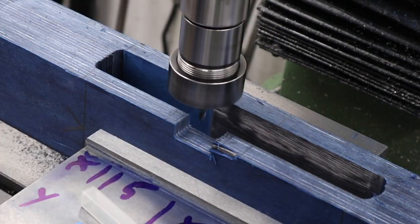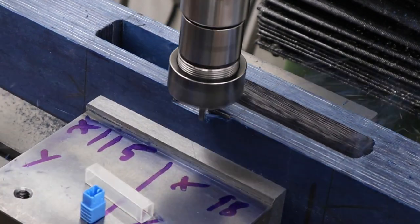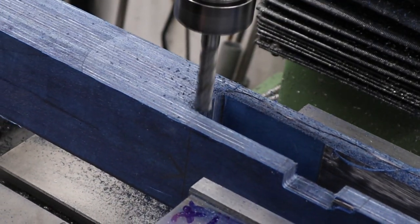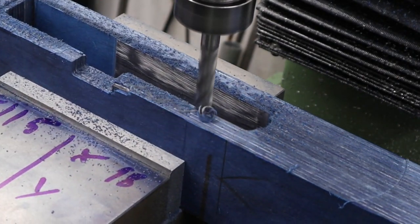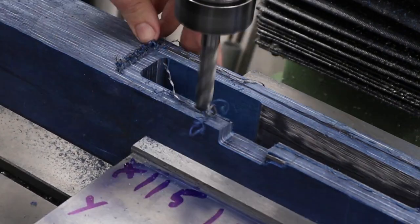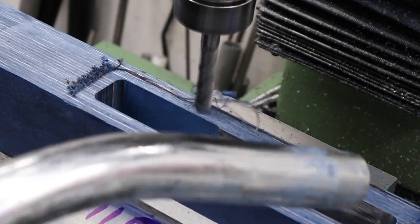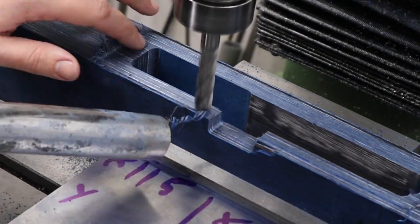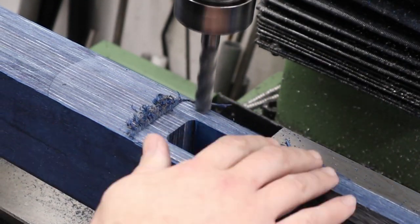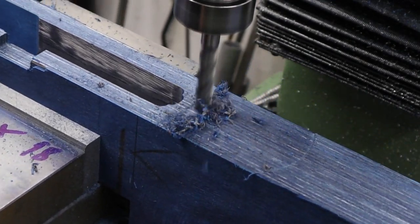You can see from the stock we did have a little bit of laminate bust out at the front, although that's not a problem as we will be milling quite a few laminations off each side to get the stock to thickness. As I couldn't use the Anschutz stock as a guide I did have to mill the action a little deeper than I would like. So the last thing to do in this setup is to mill the top of the stock to get it down to where I want it. My ideal action height is so that the floor of the loading area is just above the stock, and we're doing that with the end mill rather than the shell mill as we don't want to bust the internal laminates away and mess up the nice finish inside the inlet. Working our way around with nice thin cuts, cutting away from the center of the stock.